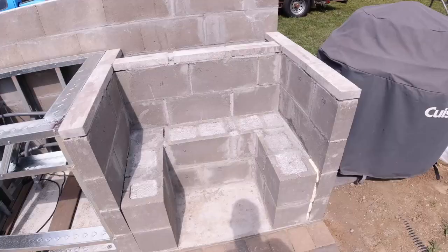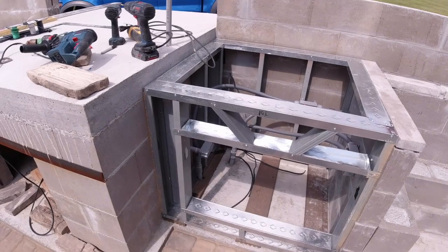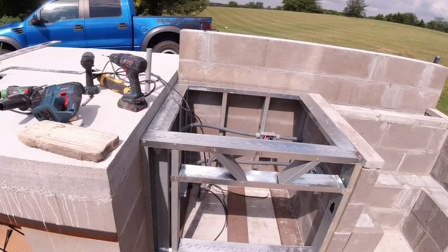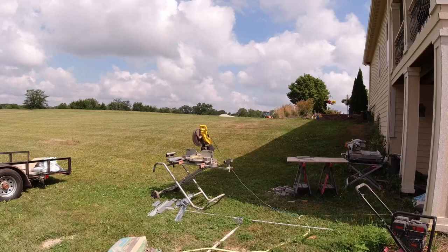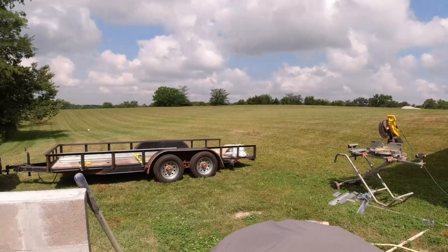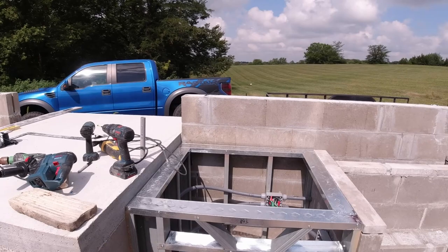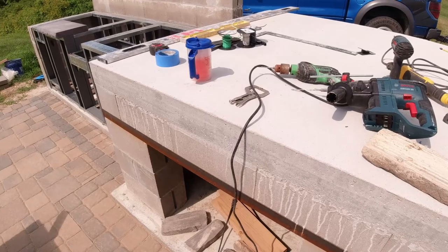Overall this project was pretty straightforward. Having never worked with metal studs before, I definitely learned a lot along the way. Make sure you wear gloves and eye protection when cutting — I used a DeWalt 12-inch compound miter saw with a steel blade, and it cut quite well, but it sends up a lot of sparks, it's loud, and the edges on these studs will get your fingers. Wear protection — you'll be thankful the first time you catch a corner or a spark flies at your face.